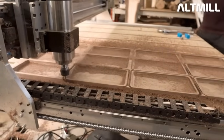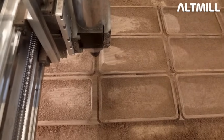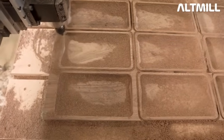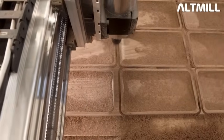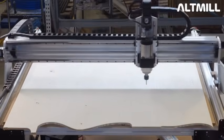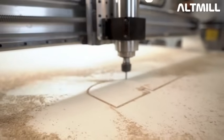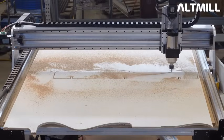It looks like they're doing this in two passes. There's a ramp down right there - when you're ramping down you want to keep the feed rate at the feed rate instead of a plunge feed. Two passes and it has cut that bowl out - they've cut multiple bowls. That's walnut. Now there's rapid travel going all the way across - that looks like 500 inches per minute. Now they're using half-inch plywood with an eighth-inch down-cutting bit or compression bit running at about 250 inches per minute.